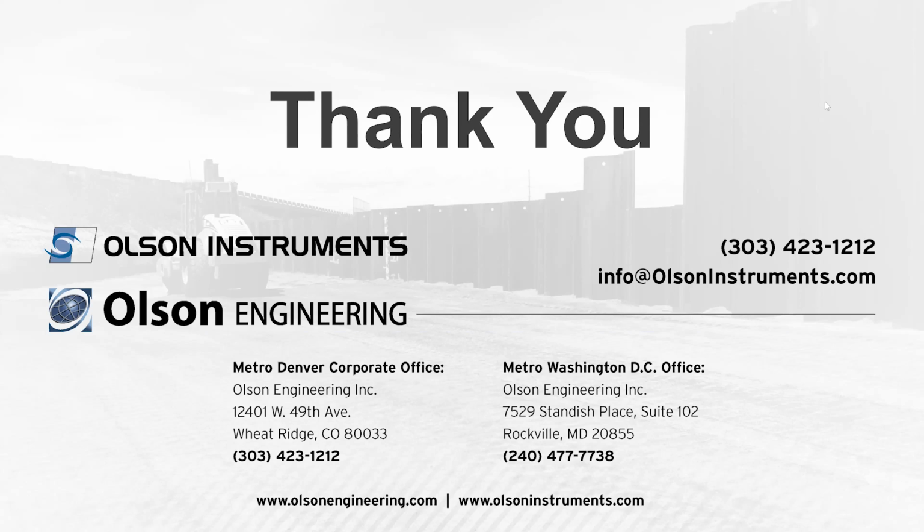But in any case, the Maryland study compared the Dynatest device, the Zorn device, and our device. You would see that readily in the available information. And they were plus or minus similar. The Zorn device does not measure the force. They assume gravity and the height of the drop to get their force, which is not so good. If you're testing on soft soils, it'll be less force. If you're testing on a stiff road base, it'll be more force from the same drop height.